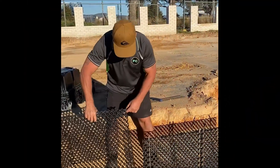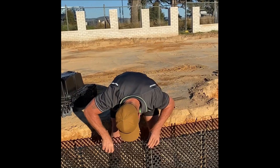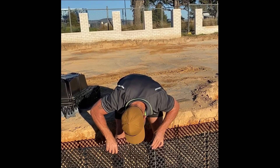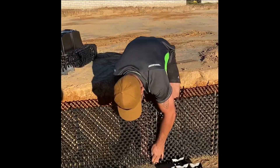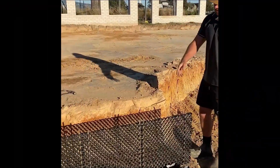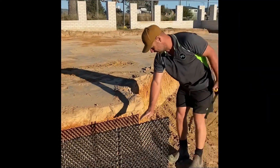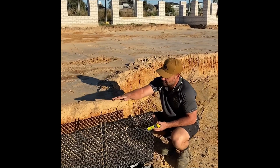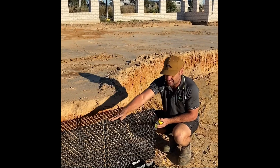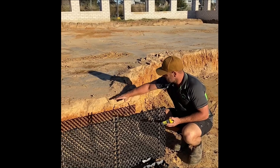You should be able to join these up as you're going, just to make it a little bit stronger. We've got them all nice and straight. We're going to come across the top. We've allowed that 30mm so that the drainage cell is going to actually sit on top of this drainage cell and sit in the base.